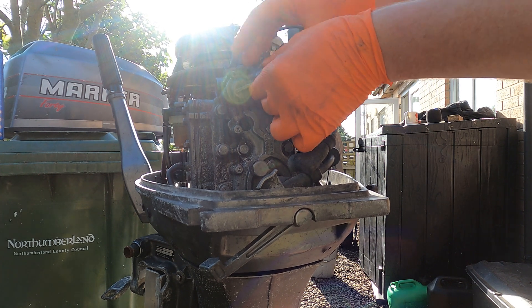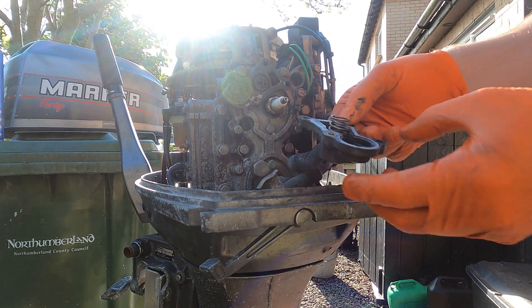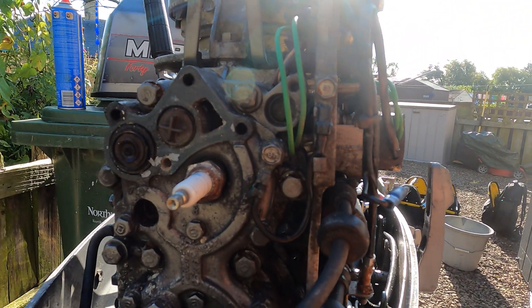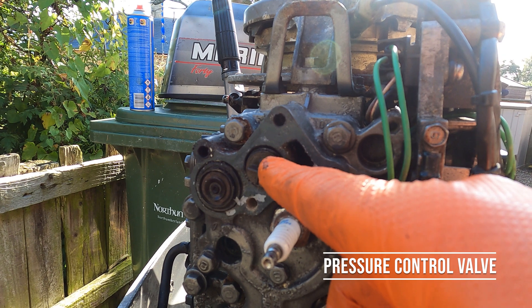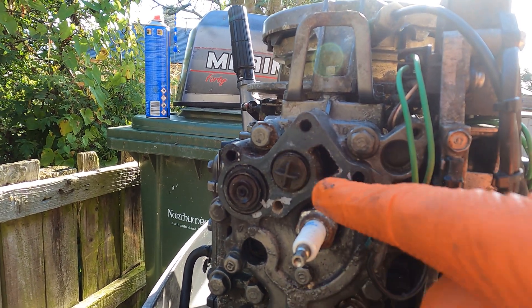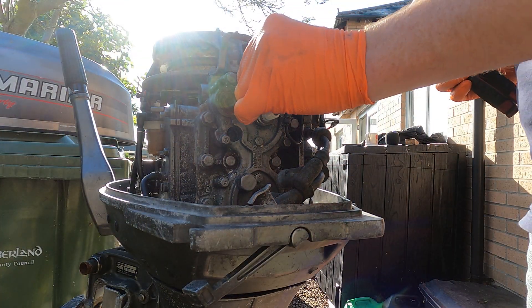There's a spring which is why it's pushing the thermostat cover back — the spring's there with the gasket. What we've got is a little sort of plug here and the thermostat's on the left. We'll remove both and inspect the passageways, then give them a test in some hot water just to make sure they're still operating. So take that little plug out first.